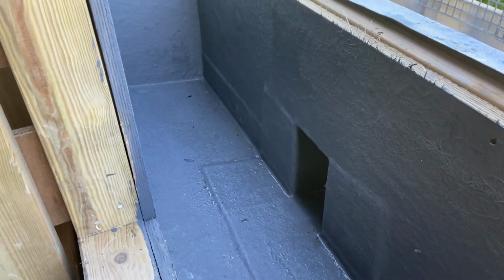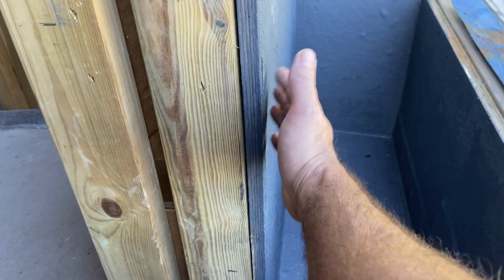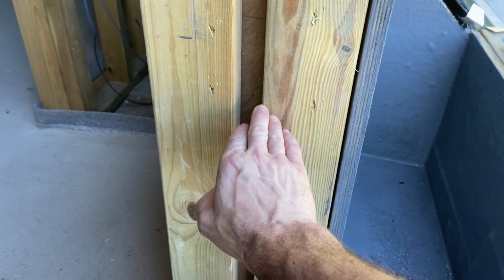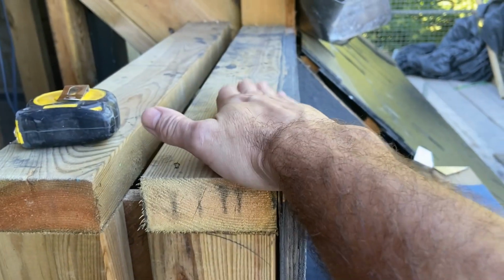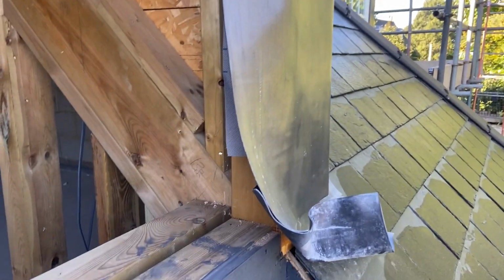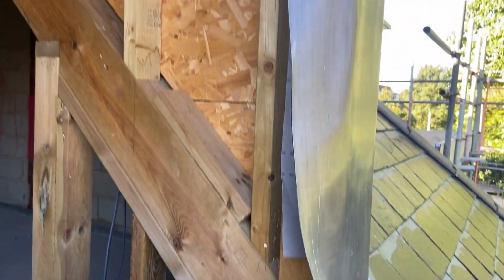So we're going to have some welted panels all the way around, basically, all the way through here, coming around here, coming through here. We're going to have a door tray through here. We make sure that we bring this cladding through inside the door opening here, and be another tray higher up. And we'll also have this dormer to finish off, so we've got an apron corner to finish off there. We'll have to dress that jamb inside and fix that as well.